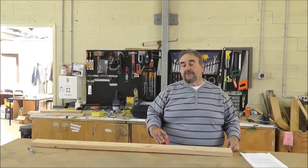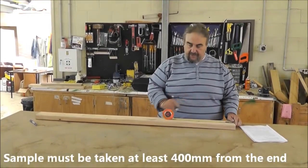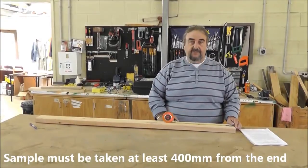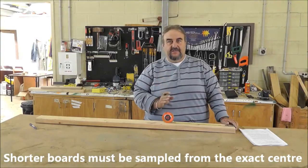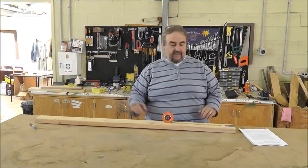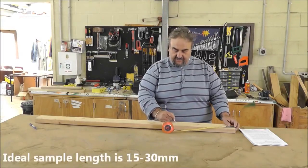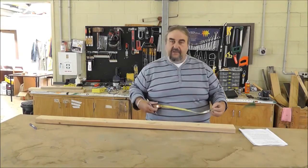Let's take a sample and look at how we measure it, dry it down, and the calculations we need to do. After choosing our board, we look at the length. There are a couple of criteria in the standard: you must be 400 millimetres from an end before taking your sample. If the sample is shorter than 800 millimetres, take the sample from the very centre. You can take it from any length piece — say a piece of parquetry — but you must take it from the centre. If the board is longer than 800 millimetres, at least 400 millimetres from the end. Sample size is taken somewhere between 15 to 30 millimetres.